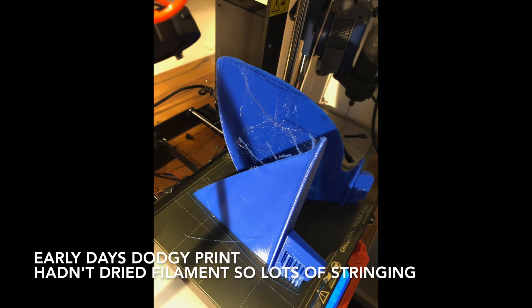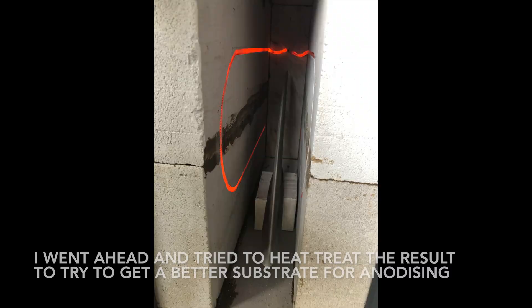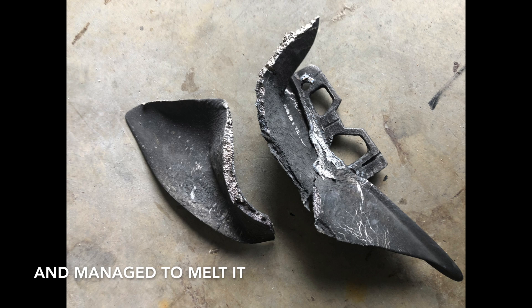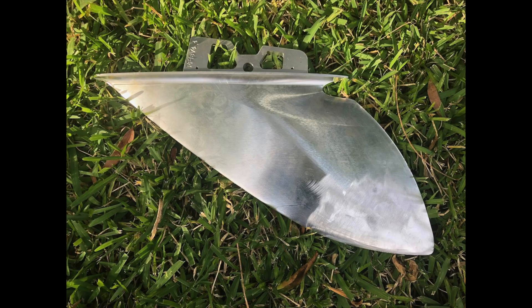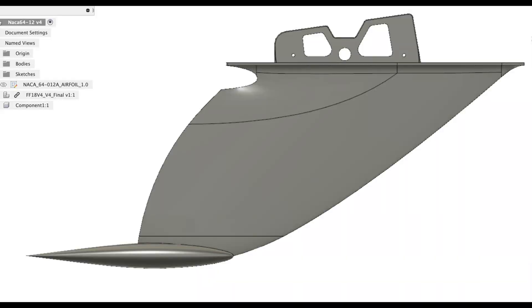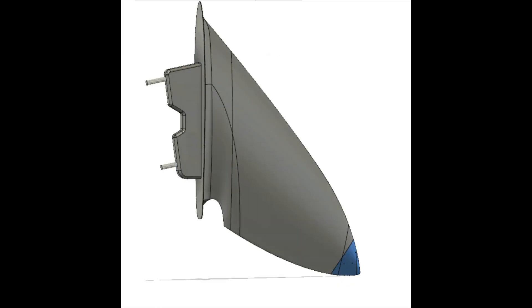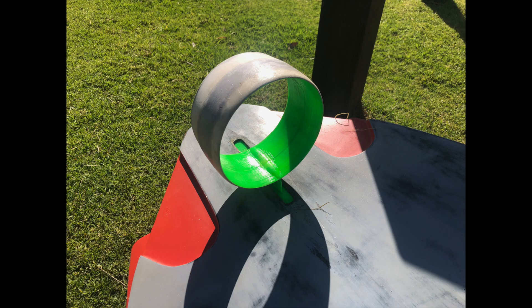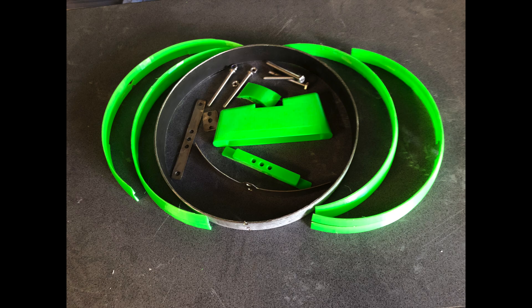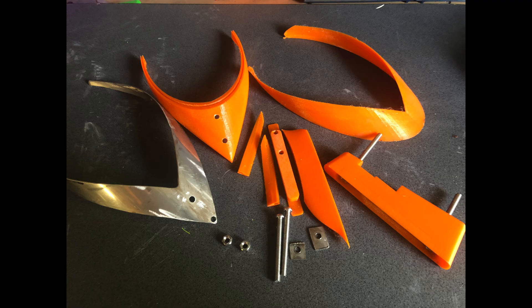The first print I made was a Fangy fin 18 based on a propeller airfoil. He still proceeded to get a sand mould made from this print and cast the aluminium fin, which was a costly and time-consuming process. In the meantime I dabbled a little with CNC fin making, but this was also expensive and time consuming. Fangy continued to push more and more designs my way and all the prints were looking really good, so I thought I'd try to print and use them directly. Initially I tried compression techniques to compress the 3D print or a light covering of fibreglass. These worked okay however they were still quite complex to make and didn't last that long. It was clear with the number of ideas Fangy was coming up with, coupled with a pile of my own, we needed a much more rapid prototyping method.